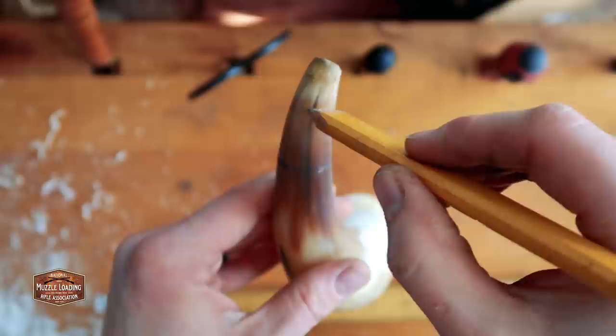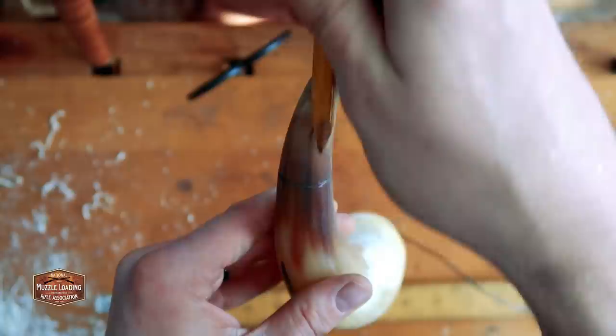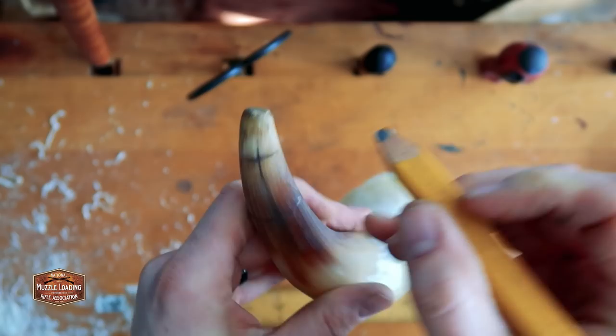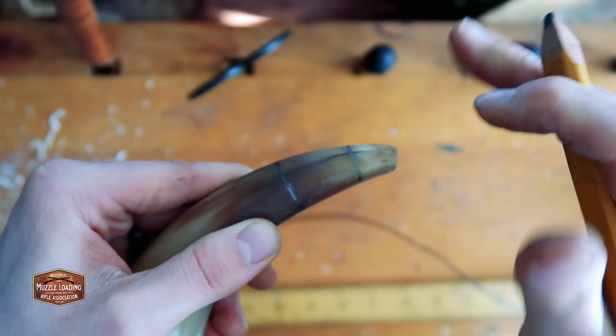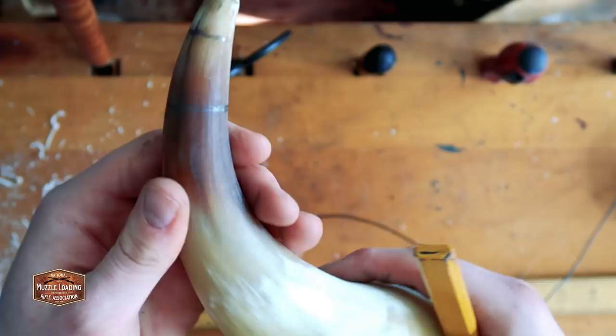We don't have to drill through a whole lot to get to our cavity. We want to think about our drill coming in and mark off a point that is fairly straight so we can get through from the new tip of our horn back into the cavity. I mark right here as a rough idea of where we should cut the horn tip off to drill for our spout. This pencil line can rub off, so if you're inclined use a felt-tip marker — the nice thing is it won't smear and we can remove that mark later with our card scraper.